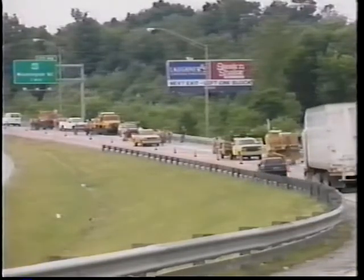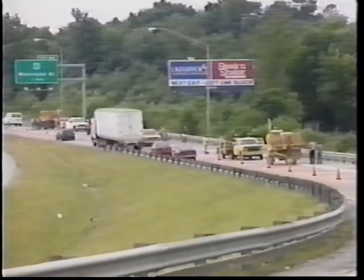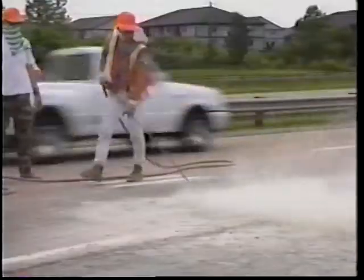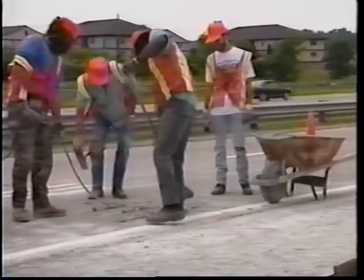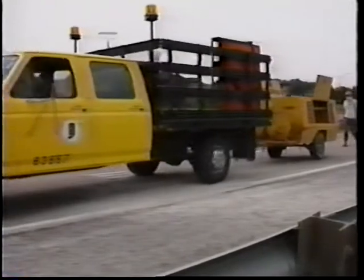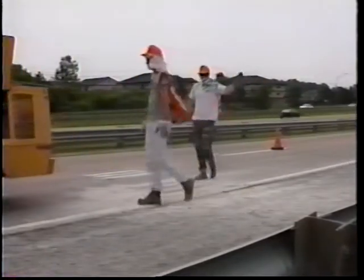A joint pavement evaluation has been undertaken by the Indiana Department of Transportation, the Federal Highway Administration, and Keystone Engineering and Indianapolis Corporation. This pavement evaluation will consist of dry milling three slots in the pavement within each wheel path, cleaning the slots, placement of an epoxy-coated number 10 rebar, and backfilling the slots with a high-strength, rapid-setting mortar. This video will briefly illustrate the series of operations which were necessary to properly install these retrofitted load transfer devices across random transverse pavement cracks which occur between the 40-foot joints.